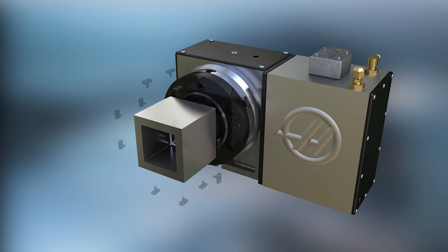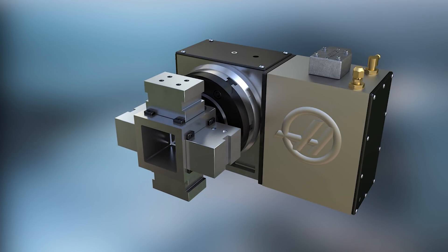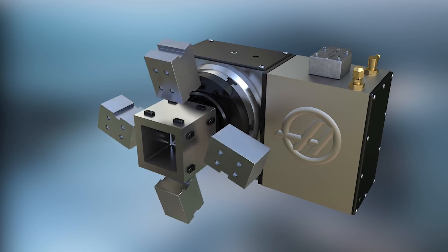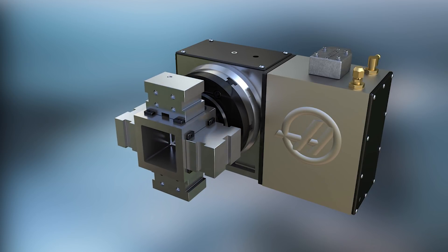The cube gives you four sides to mount smaller parts. Add low-profile clamps and you're ready to go. Machine all six faces of each part with a flip in the middle. Flip and rotate your parts, index the rotary, and now you've swapped your op 1 and op 2 positions to finish adding all those features.